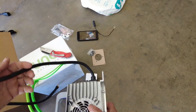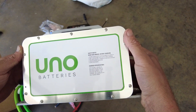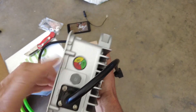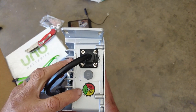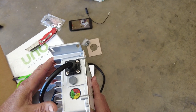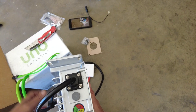They supply a 48 volt charger. Its output is 58.8 volts, which is the maximum charge voltage for this battery, with a 15 amp output. It is a smart charger with LED indicators: red means less than 80% state of charge, yellow means greater than 80%, and green means 100%. When the battery is fully charged, disengage the charger — lithium does not like float charging. You can also open the app to verify it's at 100% before unplugging.